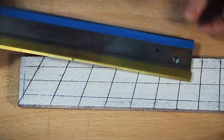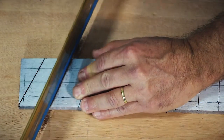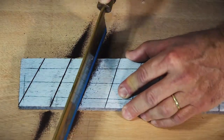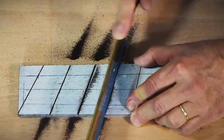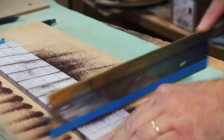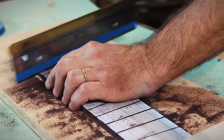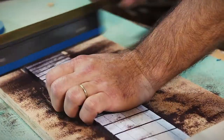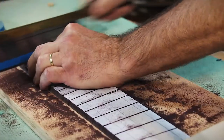We're now in the final stretch and it's time for sawing. Whip out your fret slotting saw and carefully start cutting away. I like to either put a strip of masking tape or draw a line at about four millimeters depth as a visual guide while cutting into the fretboard. Some of these saws come with an adjustable depth stop. To avoid slipping outside the slot, I guide the front side in with my finger, and after I've established some grip into the groove, I start working my way into the back as well. Do try and stay focused and consistent in your motion — this will affect the width and straightness of the slots. This will take the same amount of time as straight slotting, but if you're used to working with a jig, this will require a bit more attention.